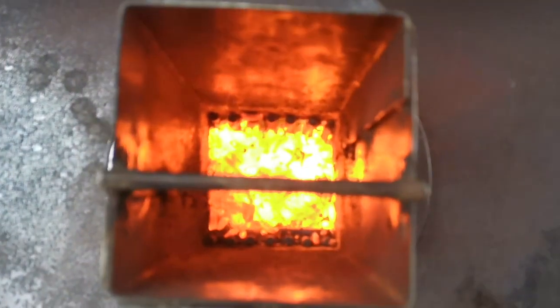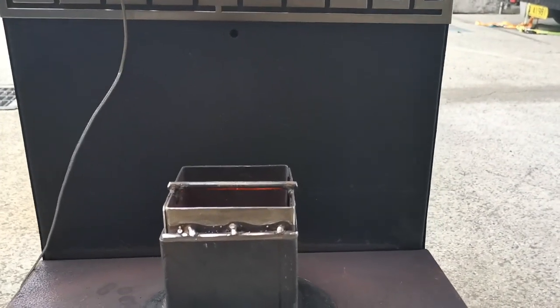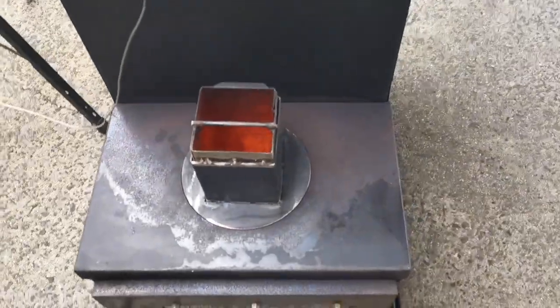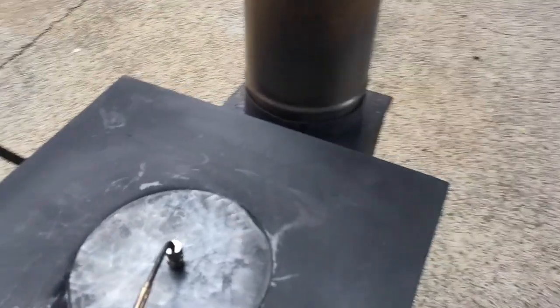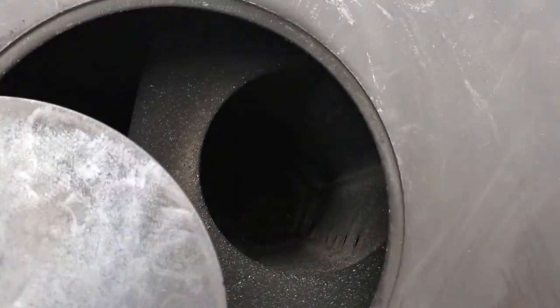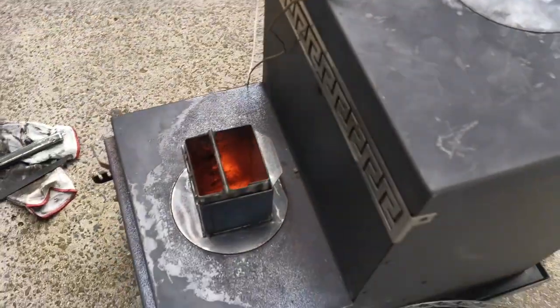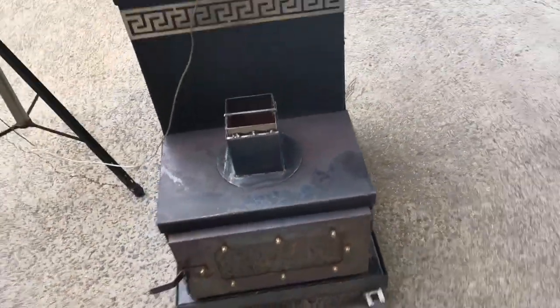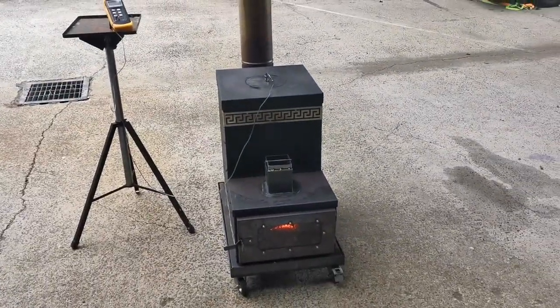So we're coming up to the end of the burn. With the door closed, there's no smoke coming out of the top here at all — it keeps drawing through there. So that's nice. Stable on around 300 at the top, which is not fabulously hot but it's pretty consistent. The rocket's just starting to finish because the fuel's finished, but it's definitely hit a stable self-feeding process, which is what we like. It's been burning clean.